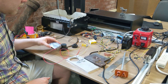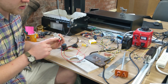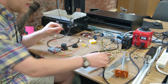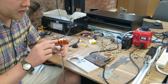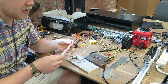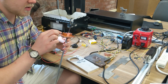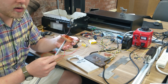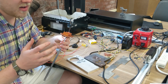So I want to start the cut today. This is just mild steel, nothing fancy. I've drilled and tapped a hole in the side so I can attach my positive electrode. And then this is going to be my tool today — it's made from quarter-inch plate copper. I cut out these shapes on an abrasive water jet, then applied solder paste and heated it to solder all these parts together, giving me both mechanical and good electrical contact. This height here is about 12 millimeters. I expect some tool wear, so I'm going to plunge this whole part about 12 to 15 millimeters deep, and I expect the resulting depth of cut will be about 8 to 10 millimeters.